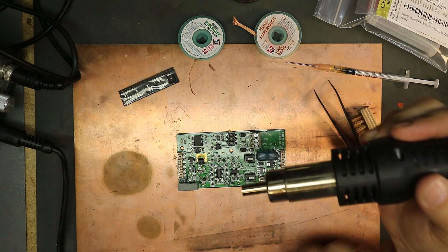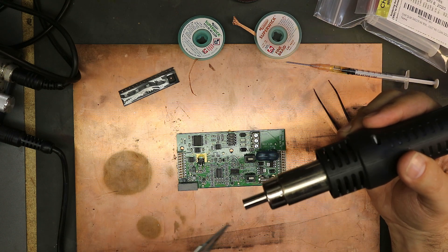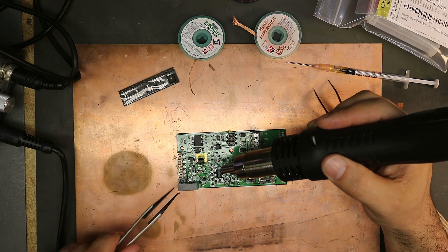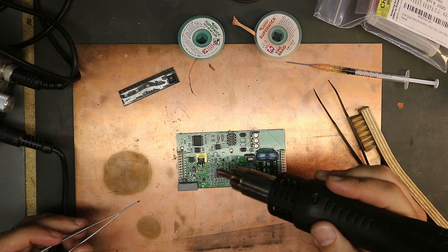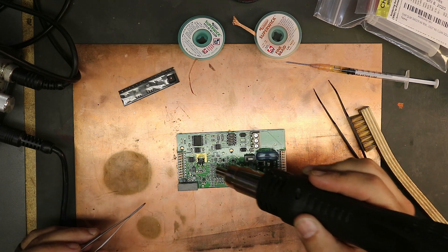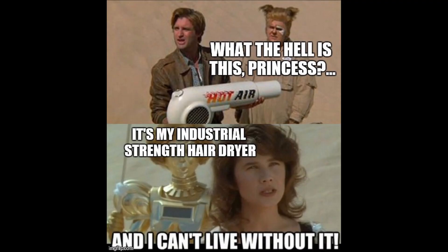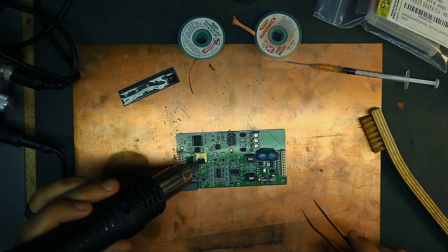My 996D that I picked up on Amazon — I really like this hot air gun. I'm using a bigger tip than I normally would, but this is a fairly big part and it's got a little bit of space around it, so I'm not too worried about tombstoning or blowing off a little passive resistor or capacitor somewhere around there. I feel like this is the right tip — they do give you an assortment of tips.